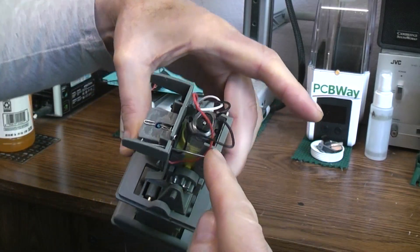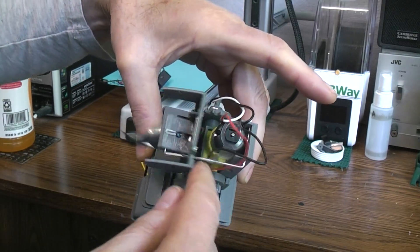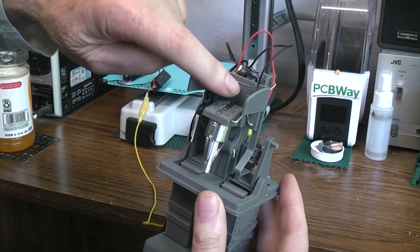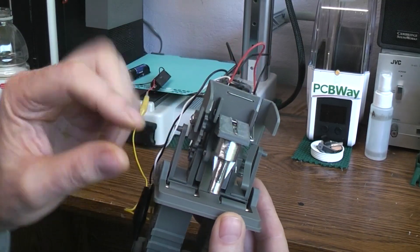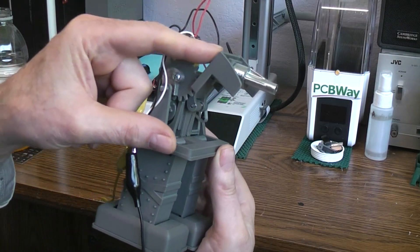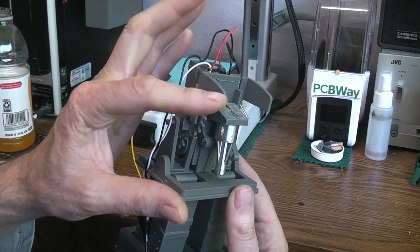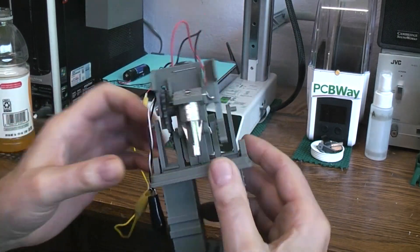This linkage right here is just a bent paper clip which forms the linkage to make the gun extend. A lot of the more basic vintage robots that had guns would come out but just attach the guns right here angled up, so that when they're all the way forward they'd be looking like that. But I decided to add the second feature, because then I not only get the advantage of that tip moving it forward, but I can add the whole length of what should fit within the door opening that I plan to build. These levers are to bump the doors open, and springs will cause the doors to close.